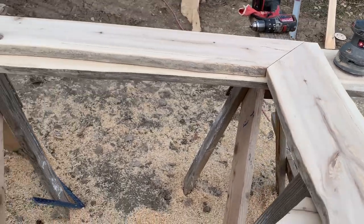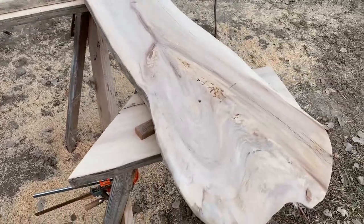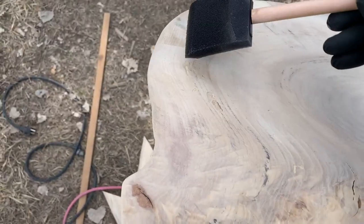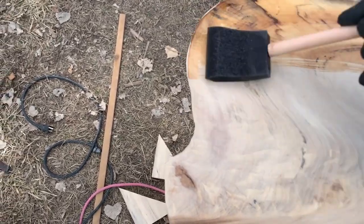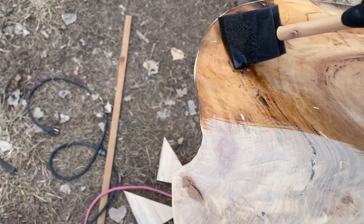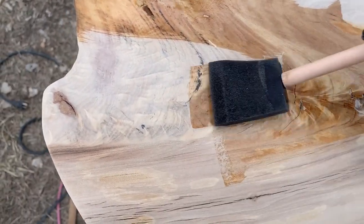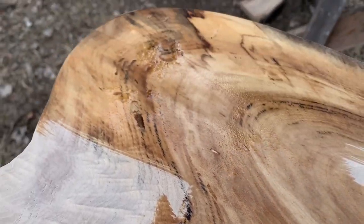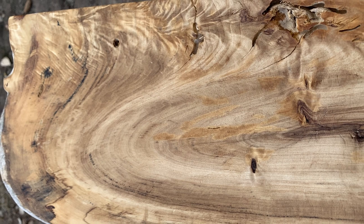The corners are just tacked, and then once we lift it into place we'll secure it directly through the top into that stud wall. Though structurally useless, cottonwood is gorgeous — look at this grain. Makes good floors too. You certainly wouldn't want to use it for anything that's going to bear any weight; it likes to crack against the grain. But for something like this, it's kind of hard to beat.